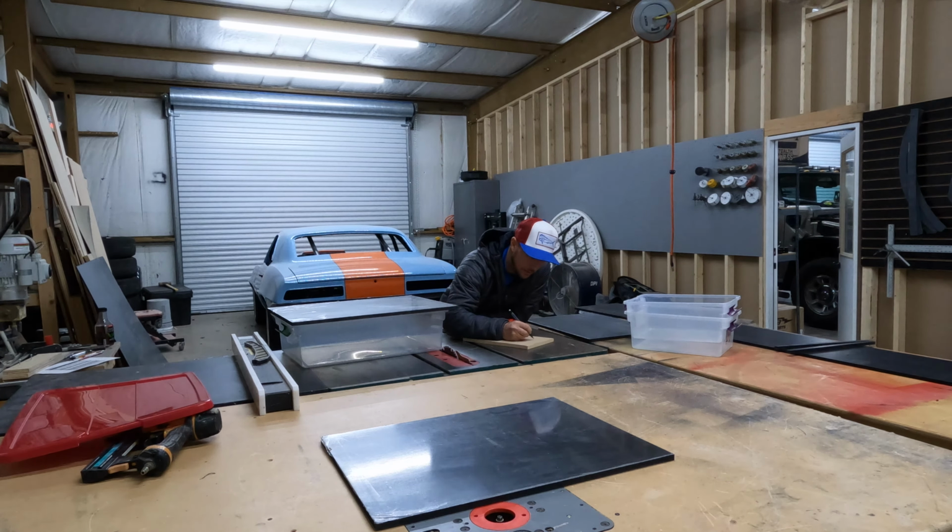All you need to really do is just line these shelves up, and then take your drill here. When you get to the very last part, you either want to use a hand screwdriver or just turn your drill and lightly tighten it up, because you will run through this plastic, or this PVC, whatever it is, like there's no tomorrow, and you definitely don't want to do that.